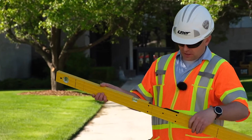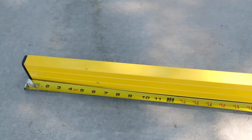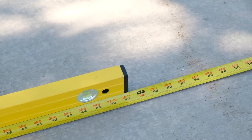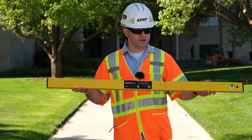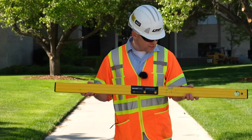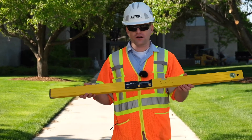Lastly, we have a 48-inch long level. Is it truly 48 inches long? No, this one measures at about 47 inches. So just be aware that if you're trying to measure a space that needs to be 4 foot, like a turning space, then it should be about an inch longer than this level.